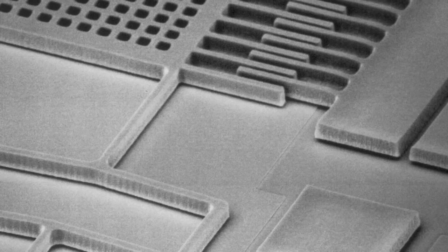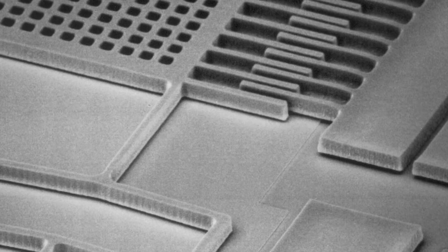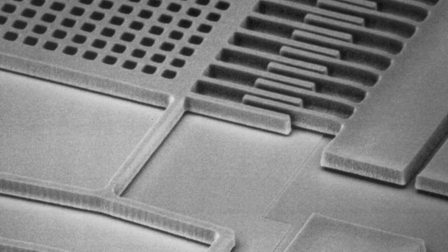People began to recognize in the late 70s and early 80s that they could take the same technology used to make computer chips and integrated circuits and look at how to make 3D structures. Instead of just using metal on a flat surface, they began to free that metal by digging a hole underneath it. At the micro scale, that metal was quite stiff, and that little wire, when free to move, could vibrate like a guitar string. This is the essence of MEMS.